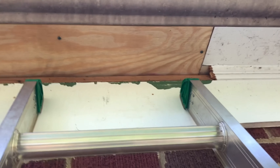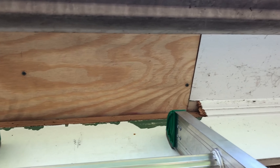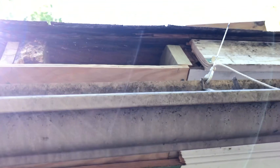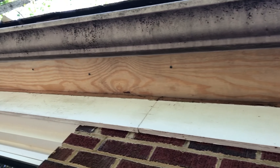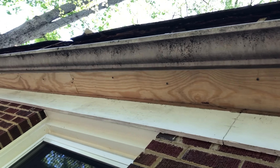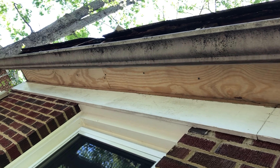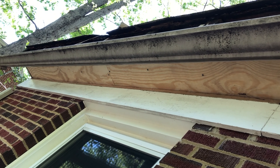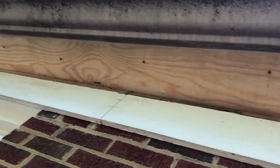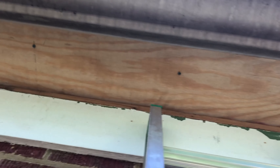For the soffit we had to use a couple of boards. Where the new soffit meets the old, this is what that looks like - about an eight-foot section and then there's a break, and then another five-foot section. So I put the soffit up in two pieces cut out of that four-by-eight sheet of half-inch plywood, just screwed in with two-inch decking screws.